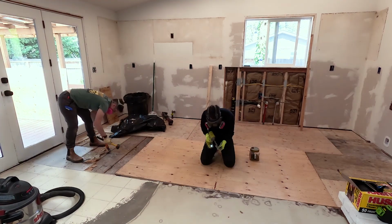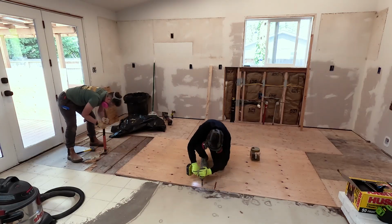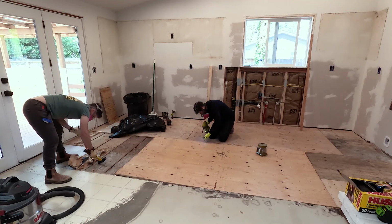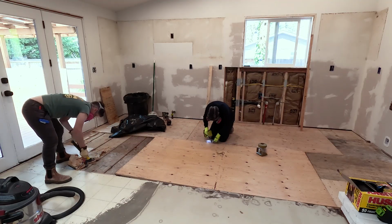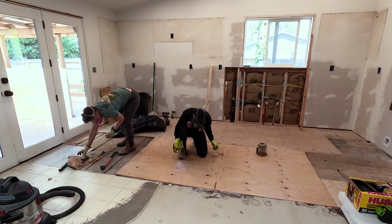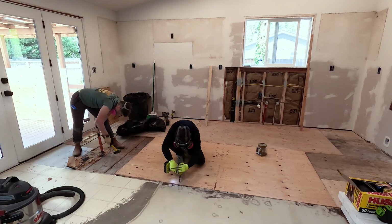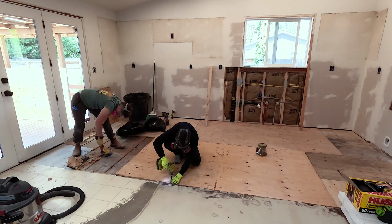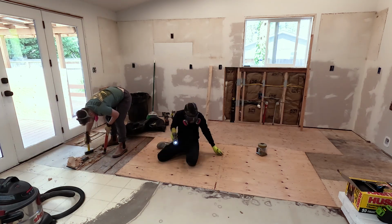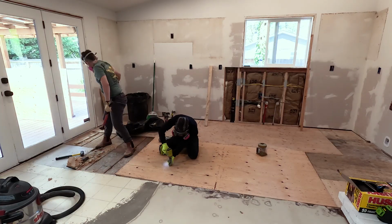Every 8 inches. This old particle board underlayment is absolute misery to pry up. What should happen is when you pound the pry bar underneath it and then lift, big sections of wood come up with the nails intact. That may be the case with plywood, but with this stuff, whenever we encountered a nail, and there were many, the board broke into tiny little chunks and crumbled into sawdust. Then we had to go back and pry out all of the nails from the subfloor. And there were at least a dozen nails in every single square foot.